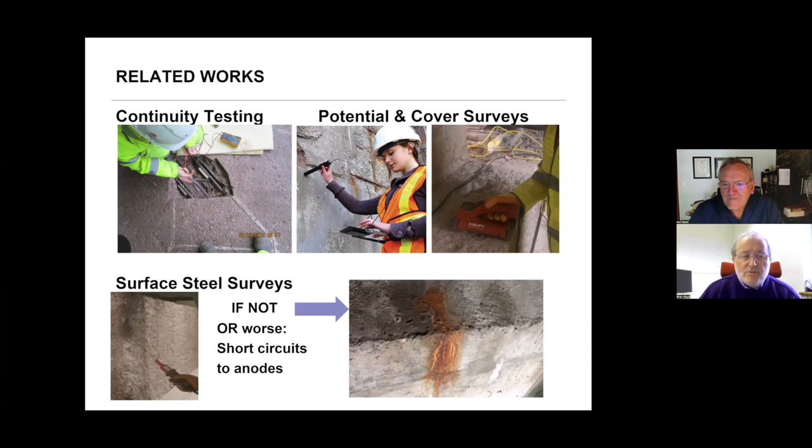Continuity testing — I see my most unfavourite instrument there in the form of a multimeter. If you try to use a multimeter to measure continuity you get continuity no matter what you do. We are actually using particular specifications of multimeter. If you use an earth megger, for example, the driving voltage breaks down the oxide films on the rebar and you get a false good value. There are two procedures in the standards: one with a low-voltage resistance meter properly specified, and the other by measuring the potential of steel in concrete to a local location whilst moving the steel test connection around the rebar.